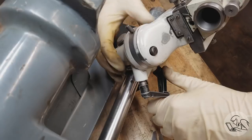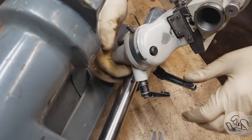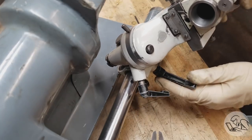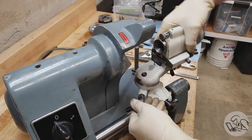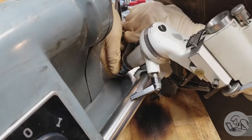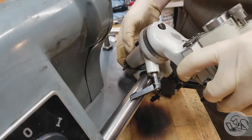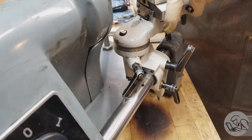I remember when I took this apart — you can actually see it in one of my earlier videos — the roll pin was short and off center, and I remember thinking to myself, 'Oh, I can make that better. I'll put a proper length roll pin in there, nicely centered.' Yeah, well, sometimes things have a reason that you don't yet understand. So be careful about thinking you're smarter than the factory engineers. There's one other little problem with the workhead: the range of motion is actually incorrect — it's off by 90 degrees. So I had to disconnect those nuts on the end, shift it to the other side of one of the internal stops, and then reattach it. Now it moves correctly. Luckily I had made those tools for those nuts, so it was an easy fix.